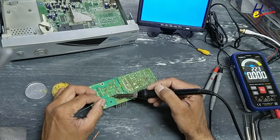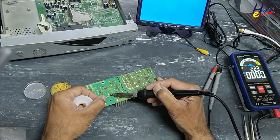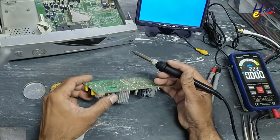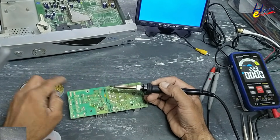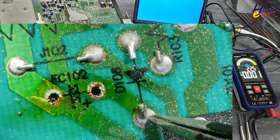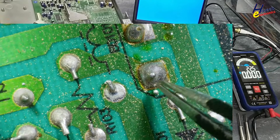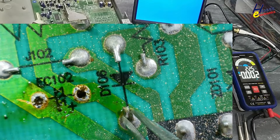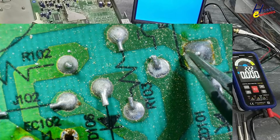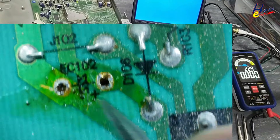This is the VCC capacitor. This is VCC capacitor, this is VCC capacitor. This rectifier, and this resistor R103 is the voltage setting resistor. If this capacitor is damaged, we will check this rectifier and this resistor in series with this rectifier. If there is any over-current condition in the VCC line —